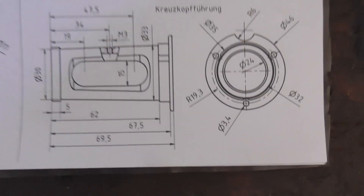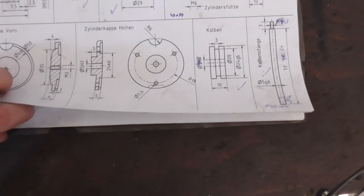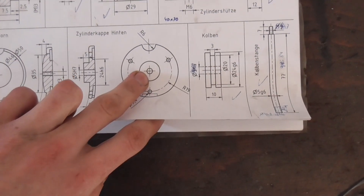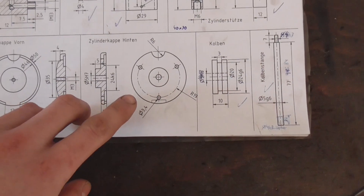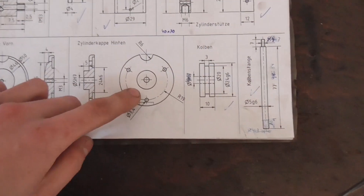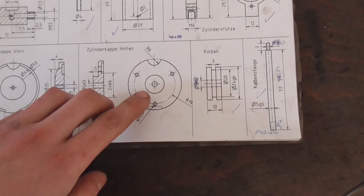So the 24mm hole is going to have to be a good one and then we're going to make a close fit to the crosshead and to keep everything aligned. I made these plans a while ago and I thought: you're actually just going over the bolt circle and then making this diameter not even register in those 24mm to assure concentricity? Well, yes. I've actually decided to leave it that way because with the bolt holes I'll be able to shift this around to a place where it will fit properly and align nicely, and not have to bother with making things too precise.